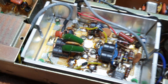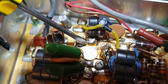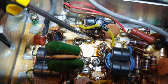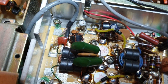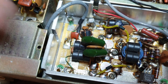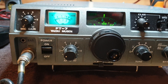We've had the board out and put it back in again. When soldering your tabs, you'll actually see the solder take to the tab - it'll kind of move forward all of a sudden. You don't need to flood the areas with solder; once they're in, they're in. That's how they look once they're in there, and this is a perfect alignment because we pulled the board in and out and placed it correctly first - so it shouldn't go wrong.